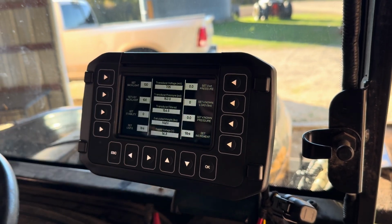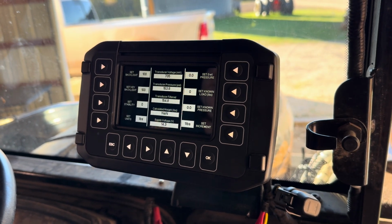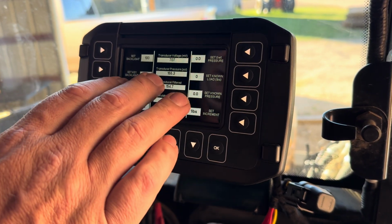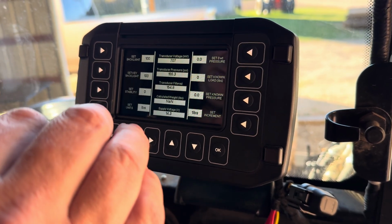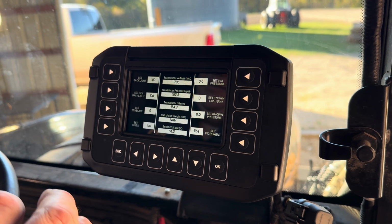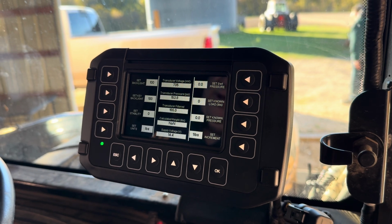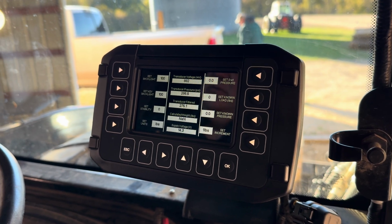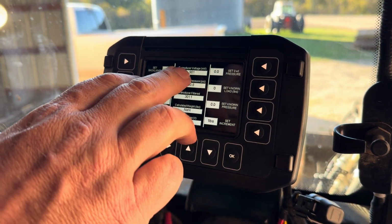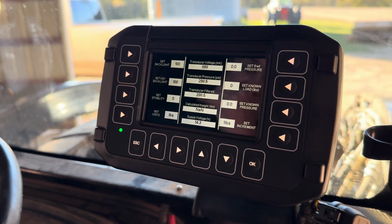What we're going to do is raise the boom to our load point we were discussing previously, and we're going to see if, when we come up to that point, the numbers settle off and hold still in a lower amount of time than if we were going to go past and come back down. So here we'll raise the bucket up to the point, and we notice that we drop off 1-2 psi or voltage, millivolts, and we're steady.